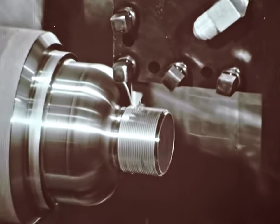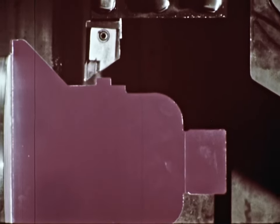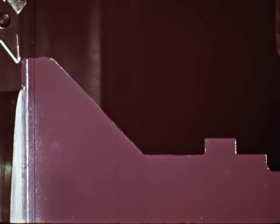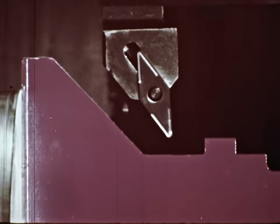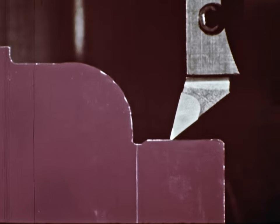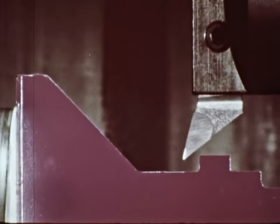Let's see some of these operations again in speeded-up action. A roughing tool cleans up the stem end, sizes the small diameter, forms the thread relief, forms contour and shoulders, removes excess metal and forms the back of the well, and forms the diagonal face. A second tool cleans up the back face and finishes the undercut. Then it indexes to the finish tool and machines the piece to required size and surface condition. Finish is usually so fine it eliminates a grinding operation.